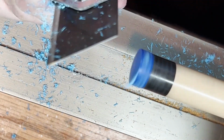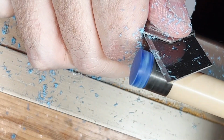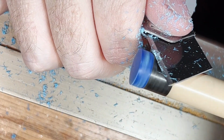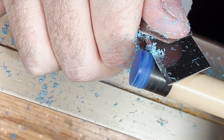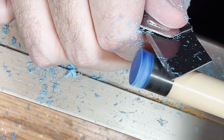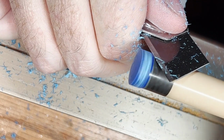What I do is I use a small angle down, but I'm not pushing in. I'm pushing and pulling across. Get that edge real good because that's where all the glue is. Be careful, extra glue will come out. Just a little pressure in, a little pressure down. Take your time. It's easier to do one tip than two. At a 30-degree angle, typically what I find.